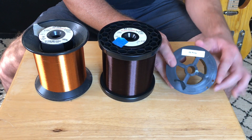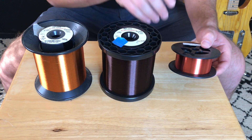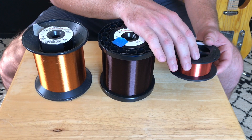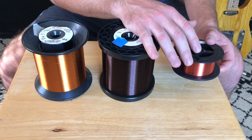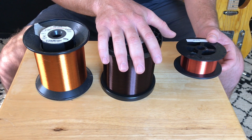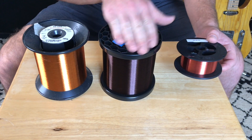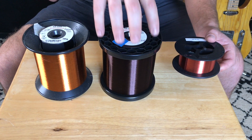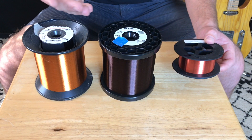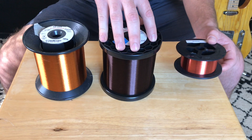We've also got the 42 poly, and you can see it's a little different color. These are supposed to be exactly the same thickness of wire, and the insulator is exactly the same, so the theory is that these should sound exactly the same. If you're buying five or six pound spools, the plain enamel can cost more than a hundred dollars more than poly. So why would you buy plain enamel? Well, if you want something to be vintage correct — like you're fixing an old pickup — then you'd want to go with this. But if you're making new pickups, why would you buy it?